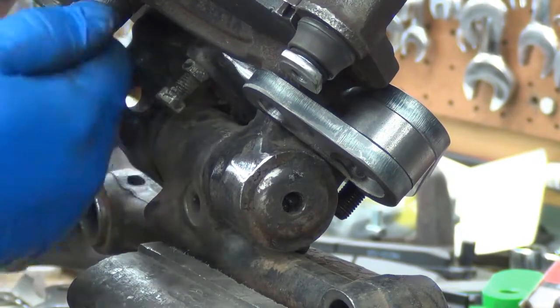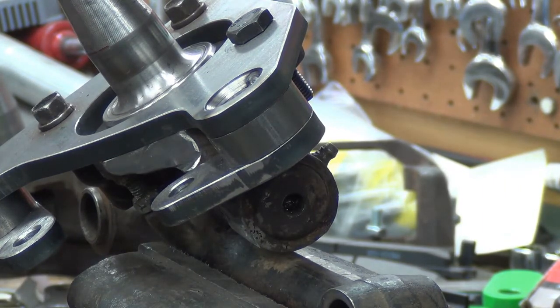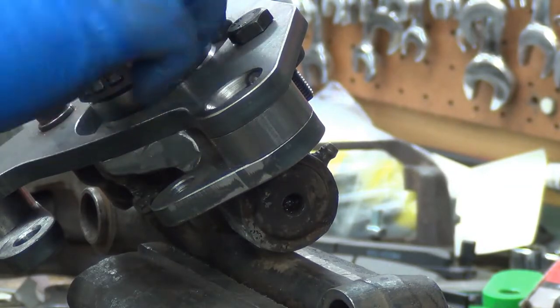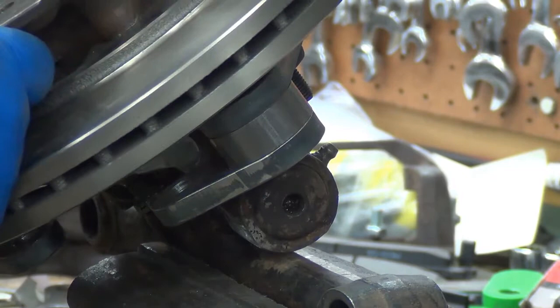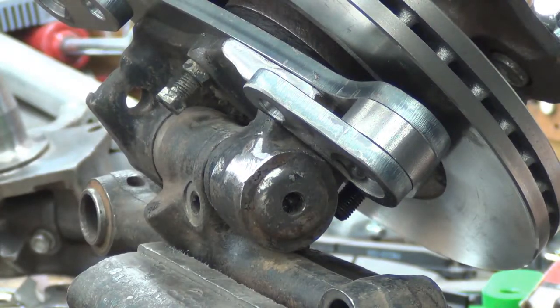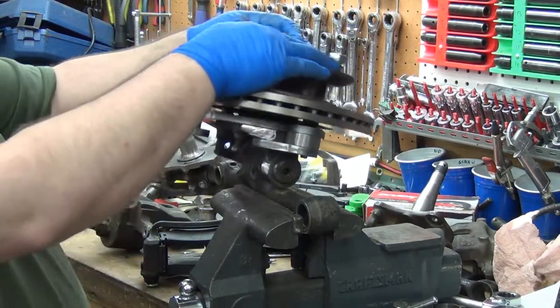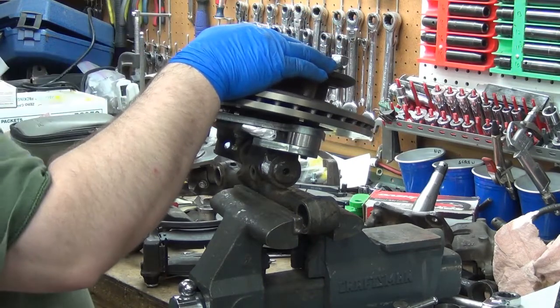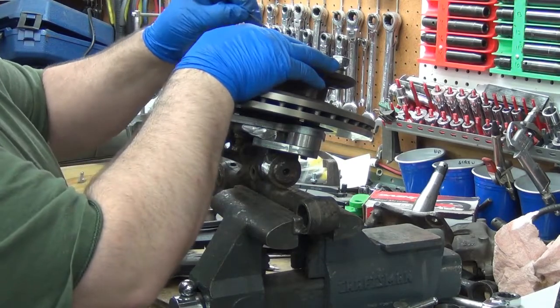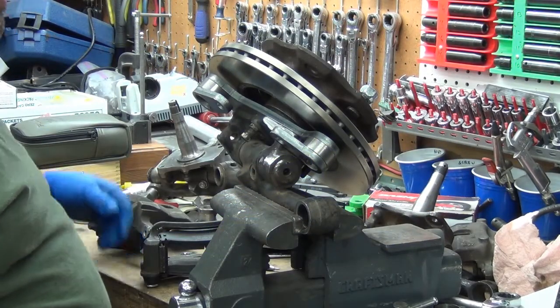Alright, I've got the clearance there. Both of these will be Allens. Okay, now that I actually have that fitting, we can go ahead and put the bearing and adapter on. Then we can go ahead and put the hub on. Alright, I suppose I should go find the crown that goes on here that holds that. This is the nut that goes on the 620 instead of a castle nut. So then you have to walk it around until you find the right one. And the cotter pin goes through just fine. Whew. Oh man, well at least that went right.